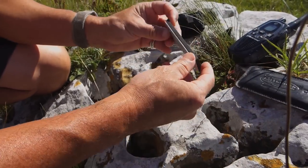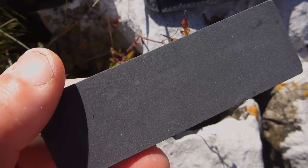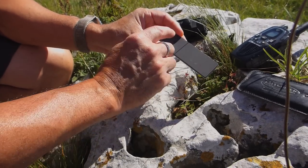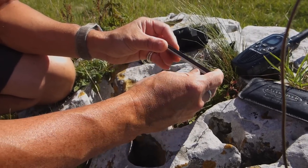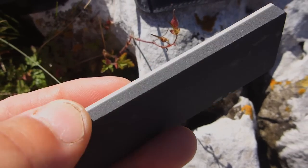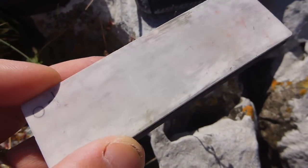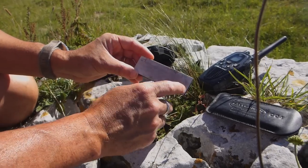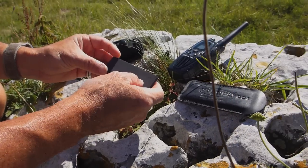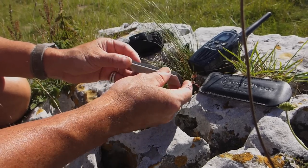You've got two surfaces to this. You've got a nice big thick surface here which is synthetic sapphire at one micron grit size, and then the reverse side you've got a much thinner synthetic ceramic at point one micron. So the other one is ten times the size — one micron and point one micron — and that's what I'm using.